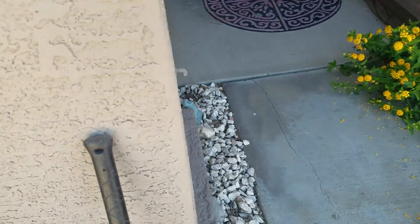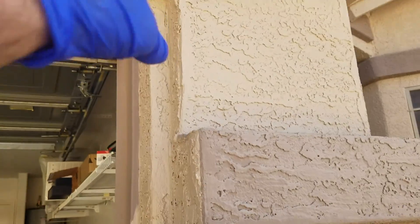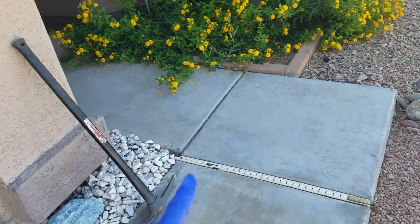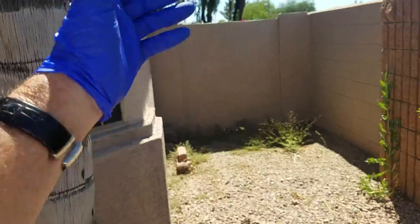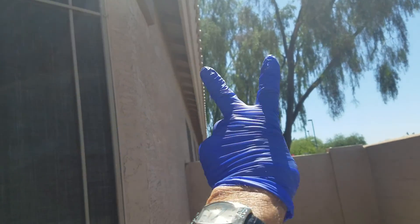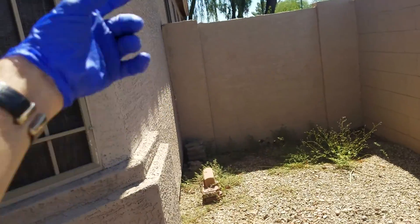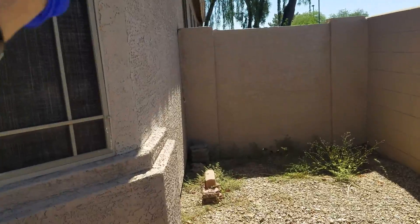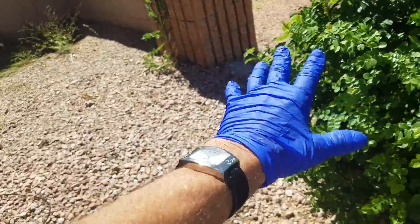You will control settlement. This side of the garage has a crack at the weakest link, which are doorways, windows, and thresholds. If this section is moving down, we're going to see a triangulated crack right here. Combined with the termites, it is undisputable — it is moisture. This is the side I was talking about for bringing the gutters out: 6-inch aluminum seamless gutters, with brackets to hold them out away from the fascia so they're level on top. You can bring it around and put another gutter out here with a double barrel downspout — it's a pretty good-sized roof. Then landscape this area so there's a small swale running through here — a French drain, if you will.